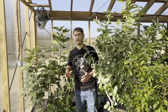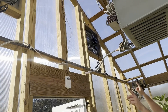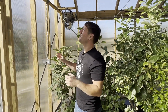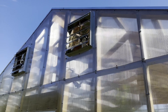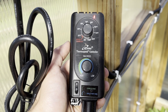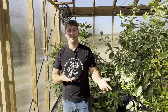If you follow me over here, I want to show you the vents. Ventilation is of the utmost importance. We have two of these 24-inch fans up here, and these things are gonna be constantly running — I've turned them off because they're pretty loud. These things are constantly gonna be sucking the heat out of the greenhouse. They're attached to thermospeed controllers, so I can control the fan speed and what temperature those controllers turn on at. That way, we're not pulling heat out in the middle of the night when we're paying for propane to heat this thing.